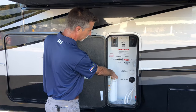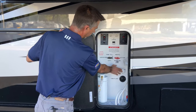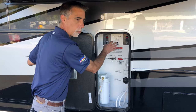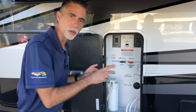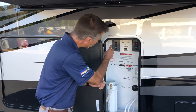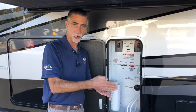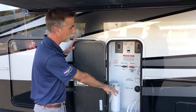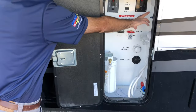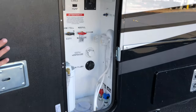We've got our whole-house water filtration system, our tank flush-out, and our city water connection. All of our winterizing needs are easily accessible right here. This has solenoid-actuated dump valves — when you hit the switch, it's open or closed instantly. Very, very awesome. I've got low-point drains in here, hot and cold running water, and even my ice maker winterizing on/off switch right there, which is really convenient.